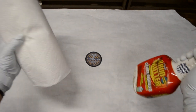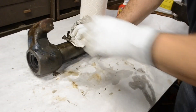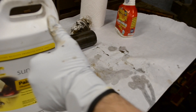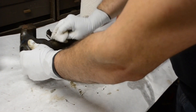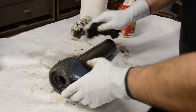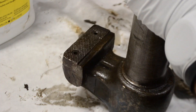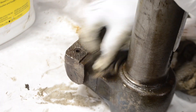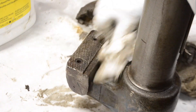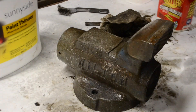I've got my table ready for some dirty work. I use freezer paper that's backed with poly to protect my table from grease and debris. Now to get all the grease off, I wound up going with paint thinner — it worked best of all the things I tried. I tried acetone, I tried my crud cutter which is my go-to, but this was just so greasy and nasty that regular mineral spirits was the way to go. I wound up using regular mineral spirits, not odorless mineral spirits, and my wife about killed me — so I recommend using odorless mineral spirits in the future.